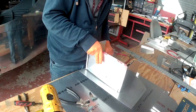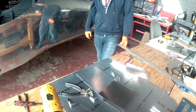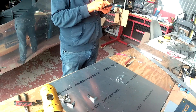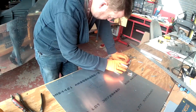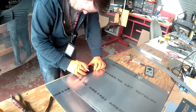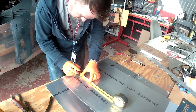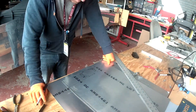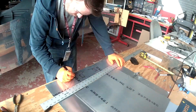I didn't really like the way that was working out. I want the G3X display's nut plates to be for solo use. So what I've done is redesigned the trays so that the four corners still use the original nut plates for the G3X system — nothing's changed there — but the trays will be completely separate, held on by three screws on each side. Moving on, what we're actually working on in this video is a tray for the GMU 11 magnetometer.